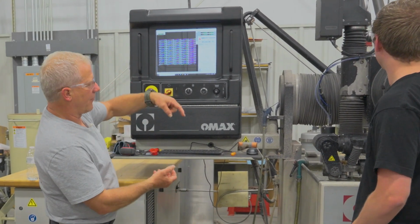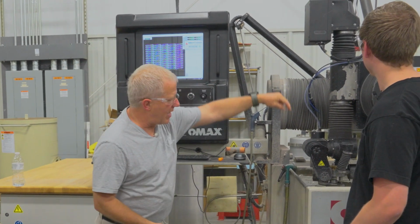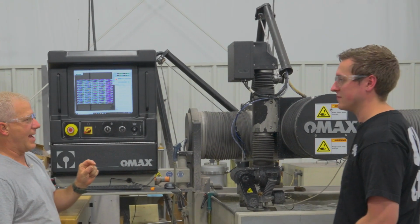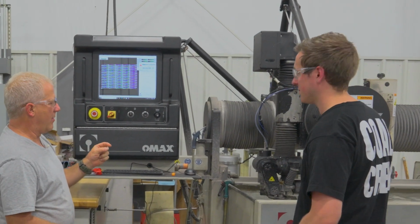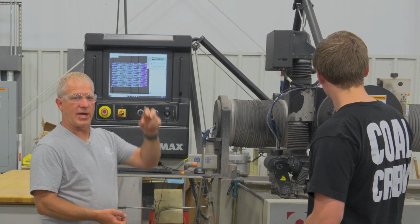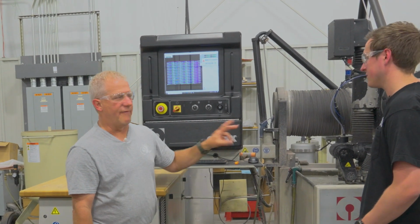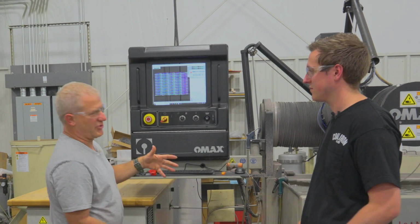All of the water comes down through a nozzle that's about 15 thou or 20 thou in diameter. And then at the very end, it injects sand in it. And that's what actually does the cutting. This is the start. So every knife pretty much starts here.